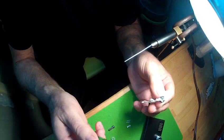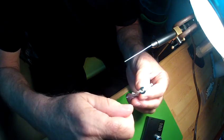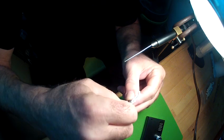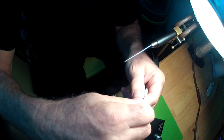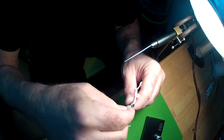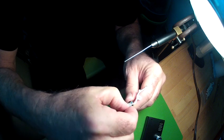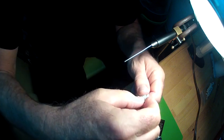You can prime this at this point, or you can just put it back together. But remember, anytime you're wicking or using cotton, make sure you give it a little time. You have to break these in just a little bit. But once you do, you can put the heat to these with voltage like nothing you ever saw, and you're not going to burn them like the traditional straight coil.